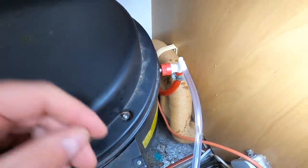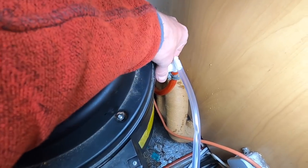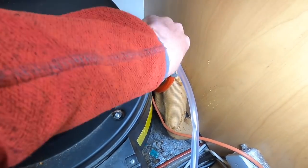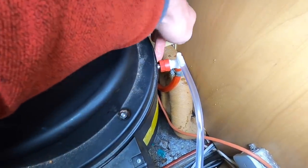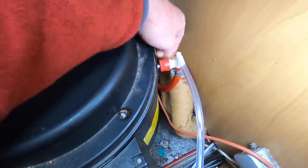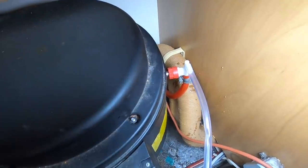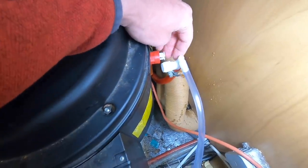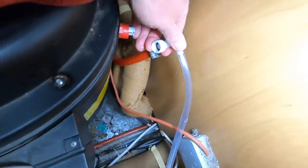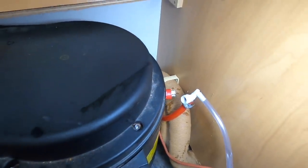So I haven't done that right. The boiler's now got water in it but this hasn't been put on properly - I had water dripping out from around here. I'm going to undo that. It needs to be on a bit closer to the boiler. You can see that the collet has not gone on all the way - I need to push that on first. The rubber's deformed a bit, so I'll sort that out.